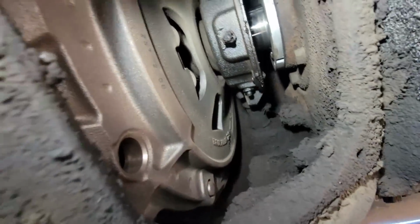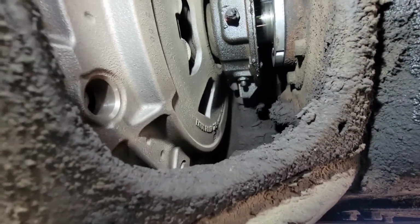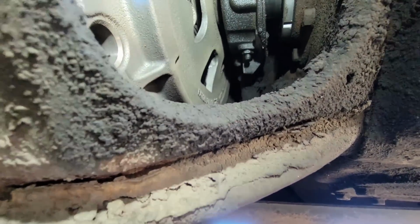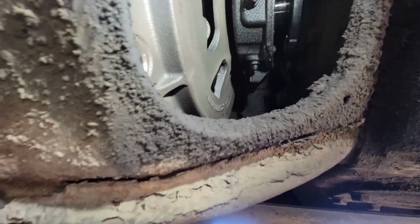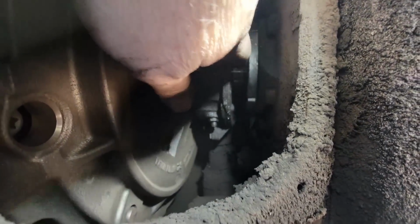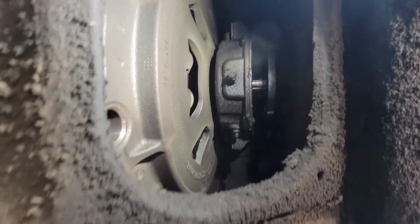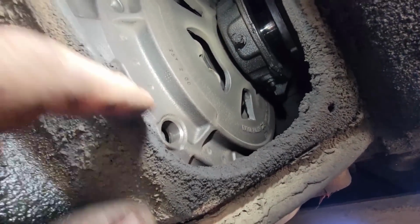This is very upsetting. The clutch needs adjusted already. You know, it was on the road for about 4 months. This is nothing more than driver error right here. Wish I could find a way to get that to stay good. Get the light in there, but I mean, yeah, I can get my thumb in there sideways. That's how much wear is on that clutch already. That stinks. It's a brand new clutch pressure plate throw-out bearing.